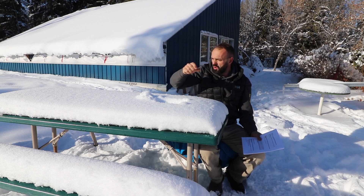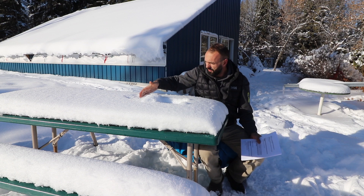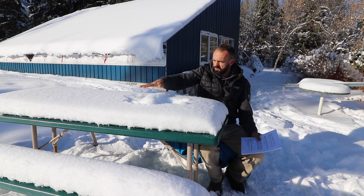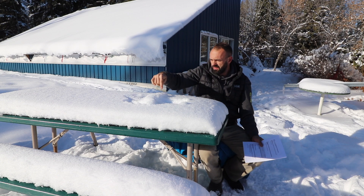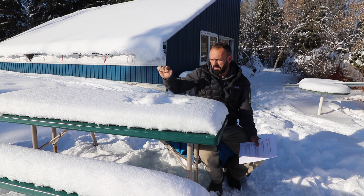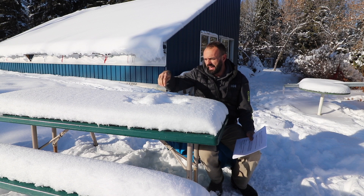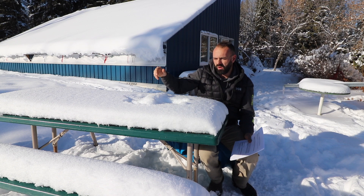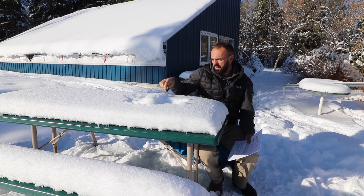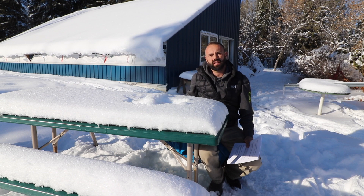However, if you're on a slope and you're creating a pond wall on the front of the dam right here, and you create a dam wall which holds water back into the landscape — if this starts to leak water, it can actually create a bit of a hazard, because you're now holding water above the landscape. So you have to be really cautious about that. We want to make sure we have a good amount of clay for the diaphragm on the front pond wall. And if we don't have enough clay in the system, that's when we would use a geotextile membrane to protect this wall and reduce that permeability to maintain the integrity of that dam wall.